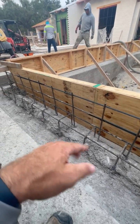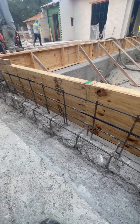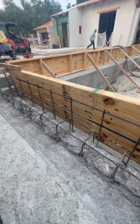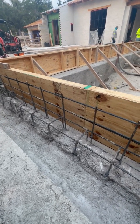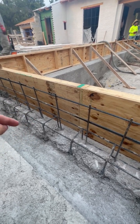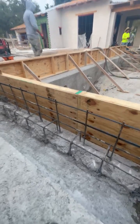This morning we're going to wet it again prior to placing the concrete, and we're going to use high velocity, high air impact to drive that paste from the new shotcrete into the old receiving shotcrete. And we will have a monolithic structure.